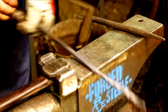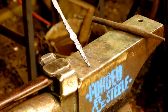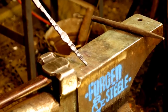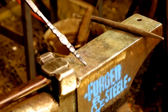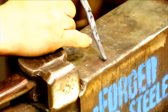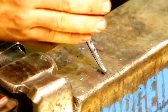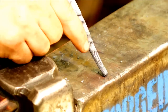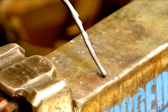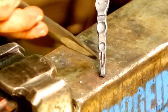You know, because of that, I don't know if you're able to zoom in on that, Sam. I know that exposure is a little high. Hang on a second, let me adjust it first. Okay, if you zoom in right here, what you see is that this piece was just ever so slightly rhombused, and that long side was out here. So when I hit that with that fuller, it tends to want to topple over, and you'll see that it's swollen out a lot more.